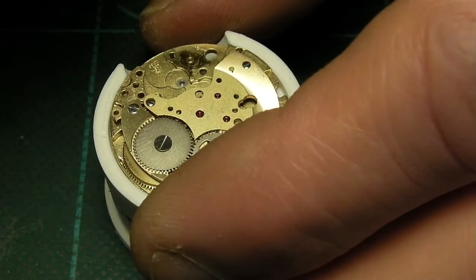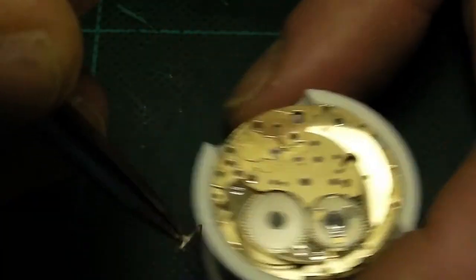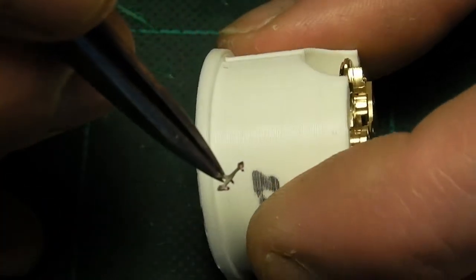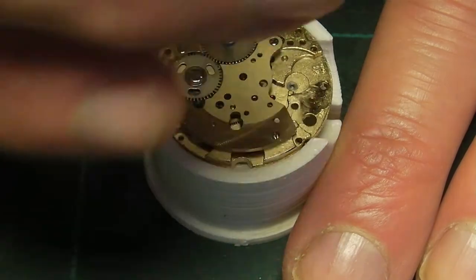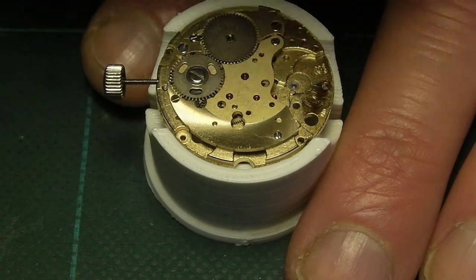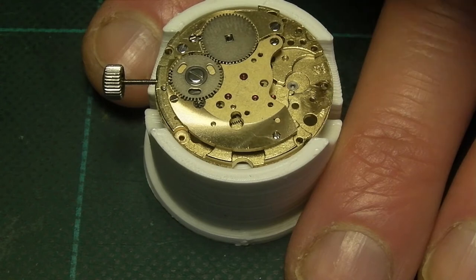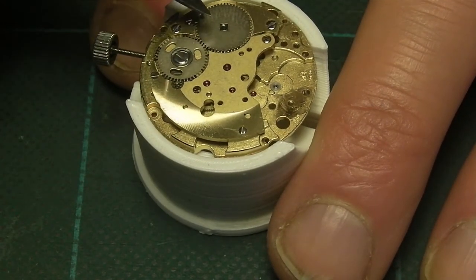And here we see the pallet fork. I do try and get that a little bit clearer in the shot in just a moment. Next for removal is the ratchet wheel. And although not shown here, you can see on reassembly, and you will see in the next video, that the ratchet wheel actually has the Rotary logo on it, which demonstrates that this has been taken apart in the past and reassembled with the ratchet wheel upside down.